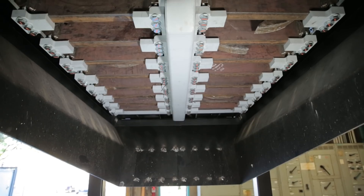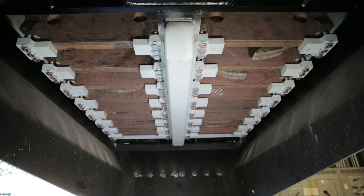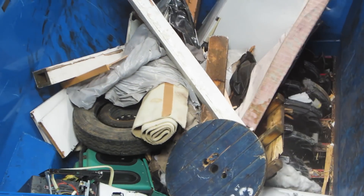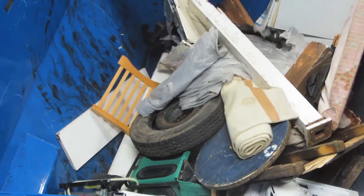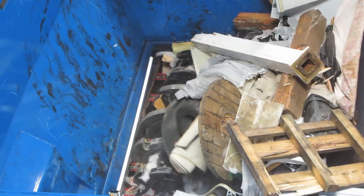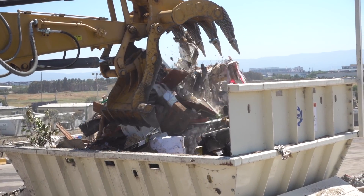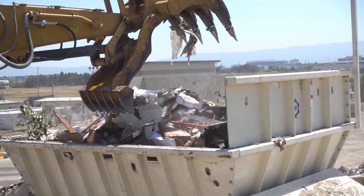The cutting table is the fixed portion of the machine that the shafts push material down through. In the process of shredding, material is punched down through those holes, including any unshreddable material. If it can fit through that hole, it goes through without even touching the cutters. If you have material like gravel that's already the correct size, it just falls through the machine without adding to your wear or anything else.